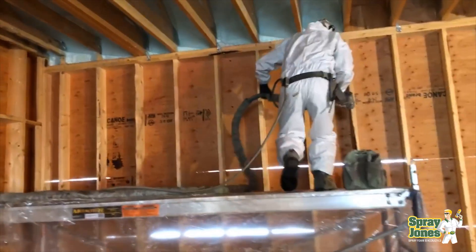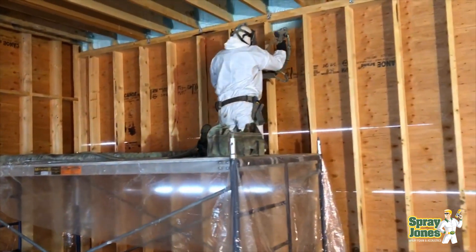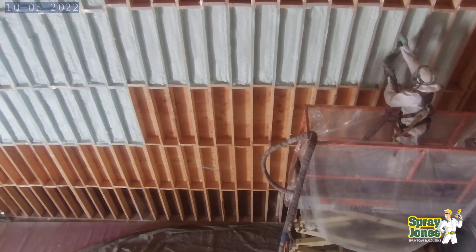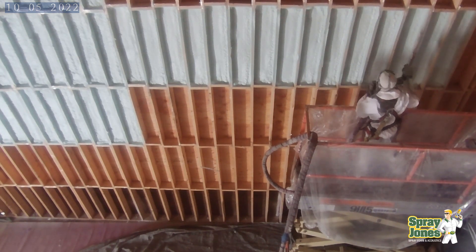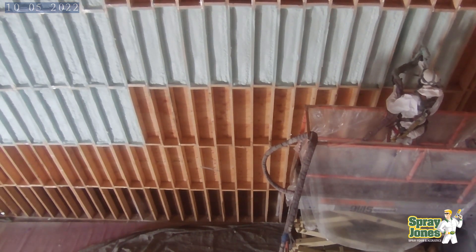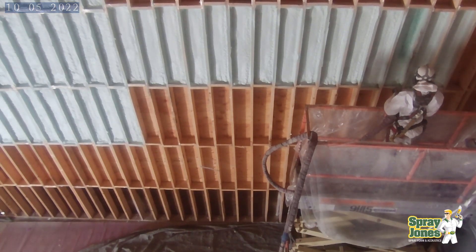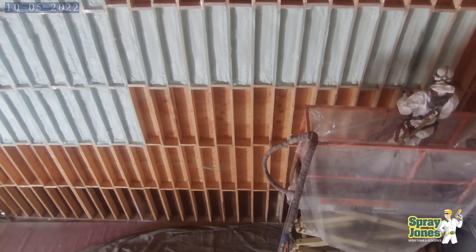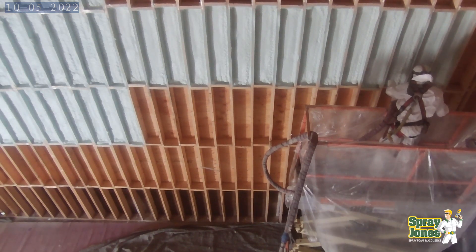You really can't leave this kind of stuff in when you know about it. You might say, can we just go around with some can foam and can-foam it into the cracks? I advise not — it's a failure on adhesion. There's going to be a space between the back of the spray foam and the substrate, and you don't want water collecting in that space and rotting out the wall from the outside inward. You might be able to control moisture from the inside out by can-foaming and sealing it, but you don't want exterior water from failed siding or compromised building wrap getting into that space and causing a problem.